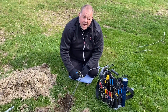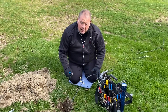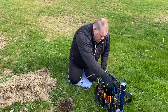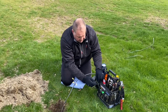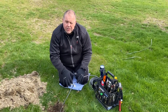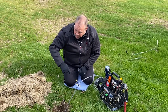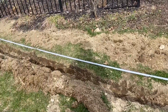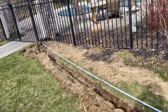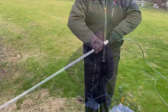Now that I have my wire nuts on and my line connected, I'm going to grab my electrical tape and tape everything off. Then we're going to run our line through the conduit — my son did a great job digging the trench — and start hooking up the electrical box and outlet.